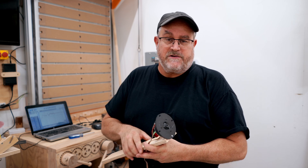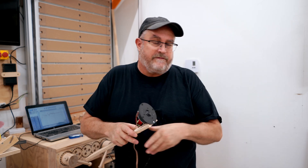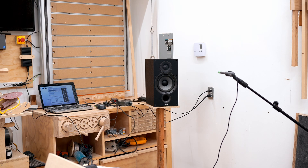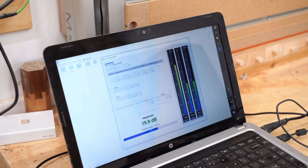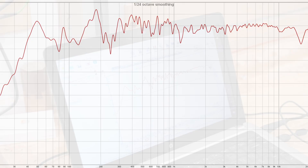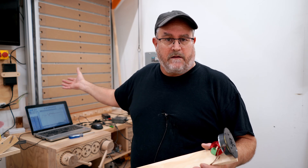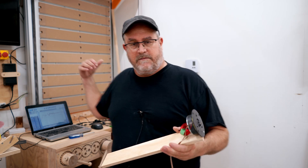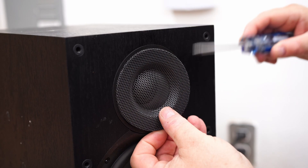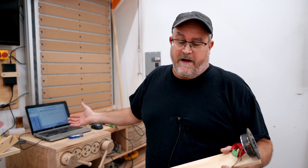The first thing I did was measure the ELAC here as it is on the stand, with the microphone one meter away on axis with the tweeter — just normal procedure for measuring speakers. The remarkable thing about these speakers is how flat they are. It's almost ruler flat from 300Hz right on up. There's a small dip at around 18K, but that's the horn — you may not realize it, but there's a horn in the ELAC. Take off the metal grill and you can see it, and that's responsible for that dip.